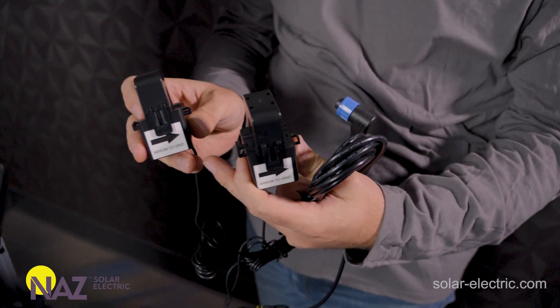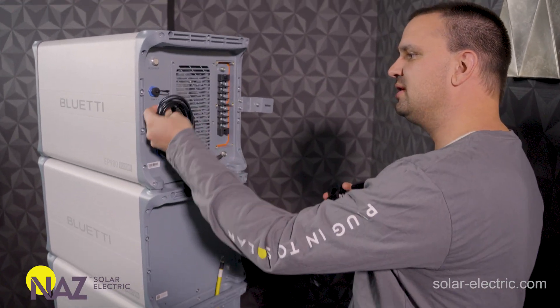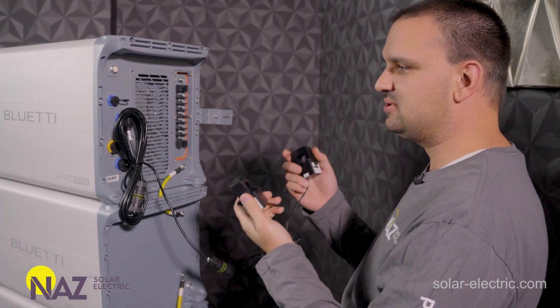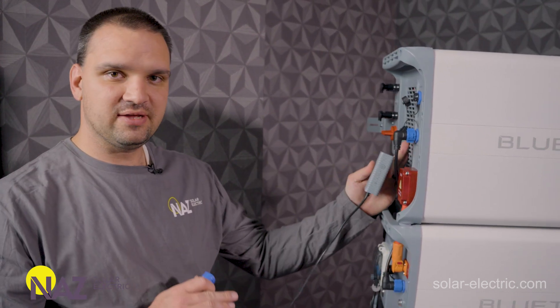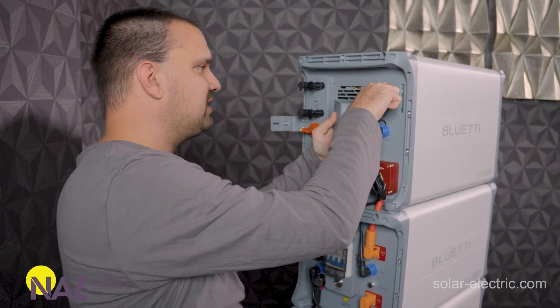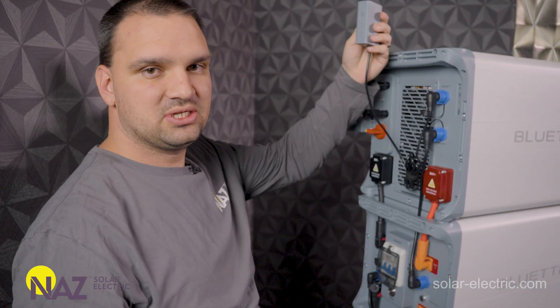Bluetti has the option to monitor loads in your house before the inverter system. They provide CTs that you wire into your main electrical panel, and the cable plugs right into the CT port here — it's watertight and only plugs in one way. This allows the unit to display loads between the inverter and your utility service. The next step is installing the Wi-Fi Bluetooth dongle, which allows you to use their app to configure the inverter, turn it on, and remotely monitor it. There's a link port up here — also watertight — and there's a mount that can be placed on the wall just outside the unit for better Wi-Fi access.